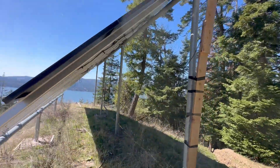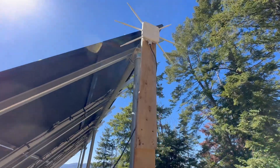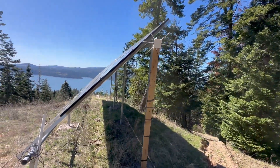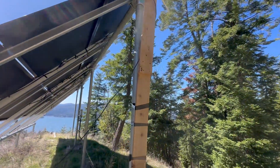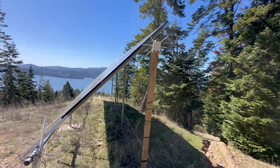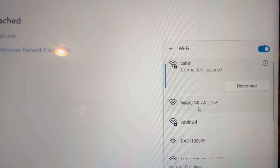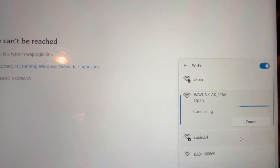There's a weatherproof gland at the bottom — important detail. You slide the cable through the outer ring, then the rubber gasket, then the plastic clamp. Once the cable's plugged in, you screw everything tight, and it creates a solid, sealed connection to keep water out. The lights on the unit turned on right away.